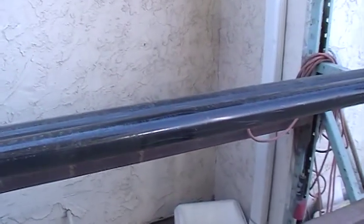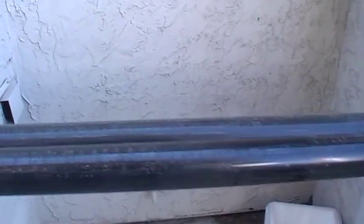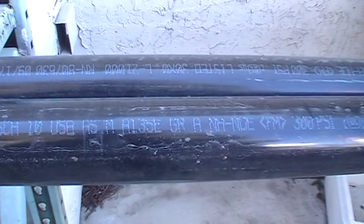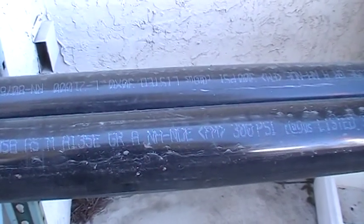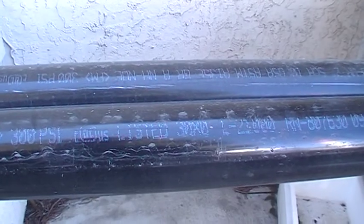What I also wanted to talk about was some steam pipe. When I was working, I welded quite a bit of steam pipe. We did a lot of cannery work, and there was always 150 PSI — because Schedule 40 is rated for 150 PSI. A lot of people where I worked insisted you had to have Schedule 80. I don't know what Schedule 80 is rated, but it's got to be at least 300 PSI. But I've got this pipe here — I don't know if you can see that — it says Schedule 10, and this thing is rated for 300 PSI.